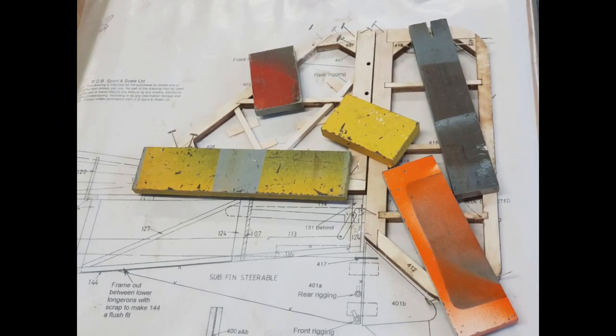Day 10. The tailplane is ready — sanded and smooth. Now it just needs the fabric covering. Next is the tail fin and rudder. They are completely double, that is every part is cut in two from 5mm balsa and laminated. A little thick but strong.